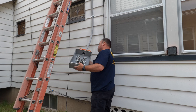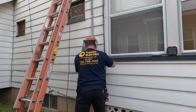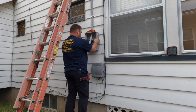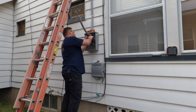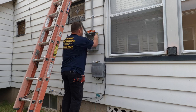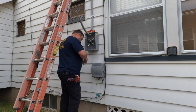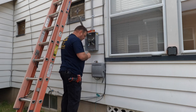This is the easiest way I know to put the wiring into this meter. I have the service entrance cable attached to the house, and I've already prepped the meter with the holes perforated out of the back of the box. I'm able to attach it with two-inch galvanized corrosion-resistant screws — core screws — and then attach the meter. Later I'll come back and do the bottom half with the same service entrance cable after drilling the hole down to the panel.